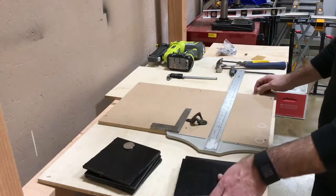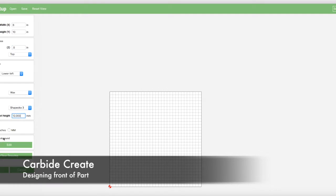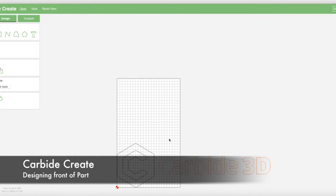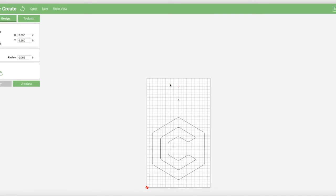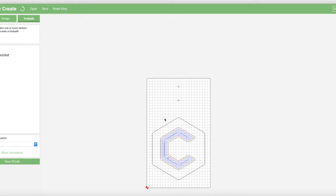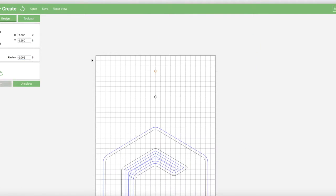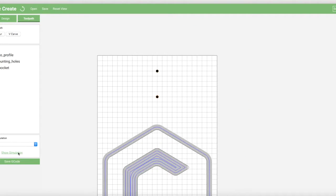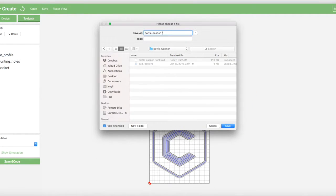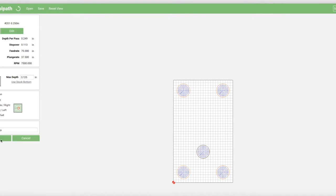The fifth magnet is going to be countersunk and then pull the bottle cap as it falls back towards the face. It's a two-sided part. I moved over to Carbide Create to do the design. I actually needed to create two different files — one for the front and one for the back. I started the job from the lower left corner for both parts as a common reference point. Once I was happy with the design, I checked it in the simulator a couple of times, then saved the G-code and moved over to the machine.